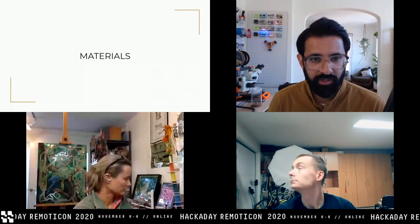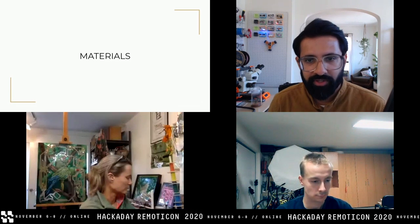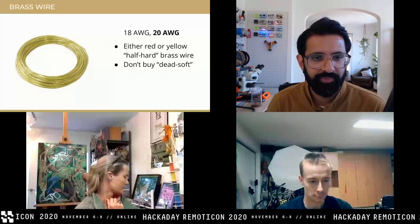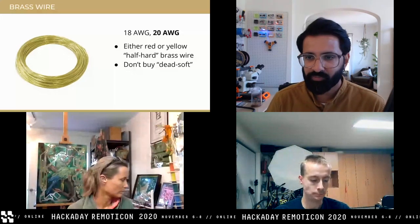We've talked about brass quite a bit. I suggested using 0.5 mm or 0.8 mm brass rods. Brass rods come pre-straightened so you don't have to straighten them yourself. Some vendors in the States are K&S Metals, based out of Chicago, and you can also find them at Ace Hardware and most hobby stores. Be mindful when buying from a craft store like Michael's — jewelry brass could be aluminum wire coated with brass, so make sure it's actually brass wire. We'll also learn how to convert brass wire into a rod so you don't always have to have a brass rod.